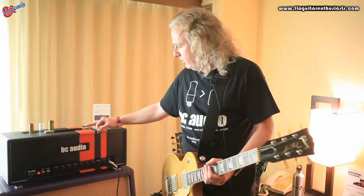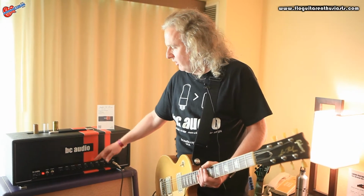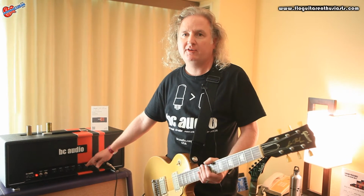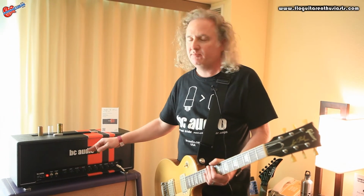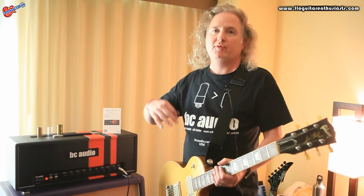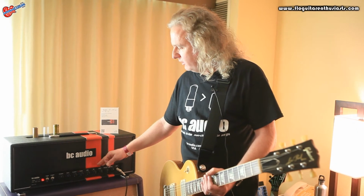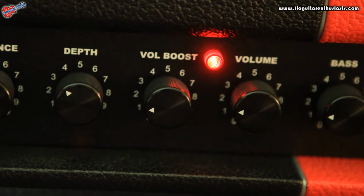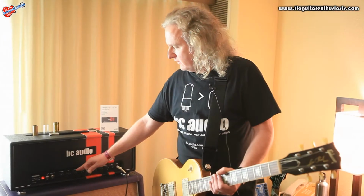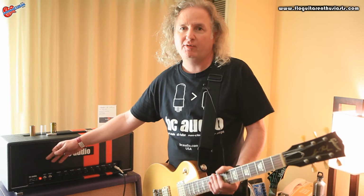Basic features of the amp include the gain with a gain boost, and you have a tone stack, which is early in the circuit. The tone stack gives you the bass, mid, treble controls, and you can tailor the sound before it gets overdriven. I'll explain why that's important in a little bit. And then we have the volume control and a volume boost. The boosts are independently foot switchable, and then there's a depth and presence controls. Depth is like presence, but for lower frequencies.